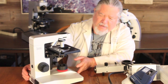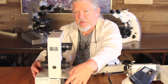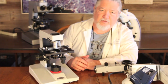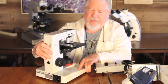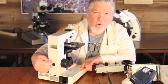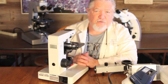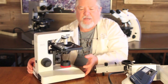Here's the Hund H600 microscope. The cable goes in here, there's an on-off switch, and there's a double fuse set in there. On the front you have a rheostat that you rotate to increase or decrease illumination. One other nice feature is that it has a port built into the back of the stand. This black cap covers a port that allows you to put a lamp house on the back of the microscope and do transmitted light fluorescence — some people need to do that — or you can do very bright transmitted light, bright field, or dark field. It's a very robust microscope.